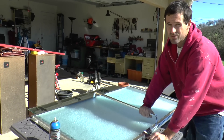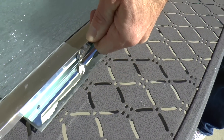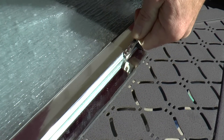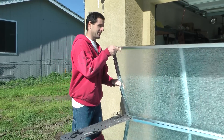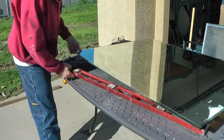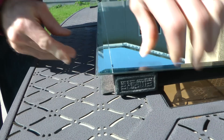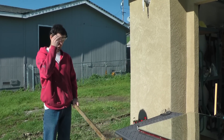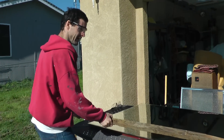Here's the big one — making the score. I need to do this in one motion, and I need to push hard enough to hear a screeching sound. Now the next step is the fun part. I need to break off just this little strip. I'm putting this level just underneath the score line for support. These are safety glasses, and it should be interesting whatever happens.